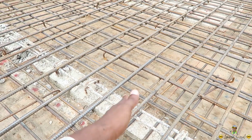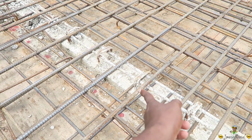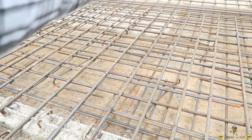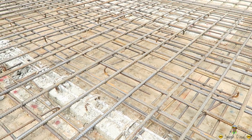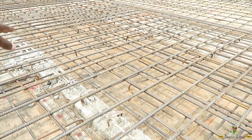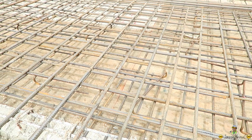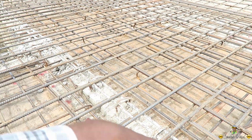It's normally the case that every 15 feet you have a column, meaning you have the stiffener columns in the wall, and it comes across as a beam and laps across the building. I believe the span is 40 feet. So we're going to look at the drawing afterwards, but this is just a quick run through with you guys. So 15, so one would be in the middle somewhere.